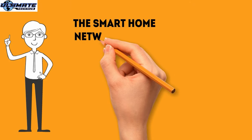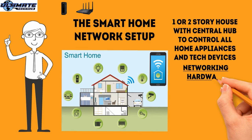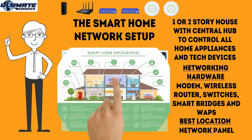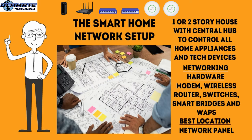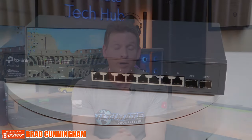The sixth and final home networking diagram is the smart home network setup. If you love tech and love the idea of a smart home — where doors, appliances, thermostats, lights, and virtual assistants provide all the conveniences that make life easier — this setup requires reliable wireless access points and some wired connections for smart appliances and security cameras. It uses the same components as the two-story home network setup and will also work with two-story homes. It's very important to ensure all devices have a strong connection to a wireless access point — this is critical for smart lights, smart thermostats, smart home locks, and smart garage door openers. You'll often need a switch to make a wired connection from the router to a more distant part of the home, and using switches with PoE ports will allow for easy wireless access point installations, ensuring all your IoT devices have a reliable wireless connection.